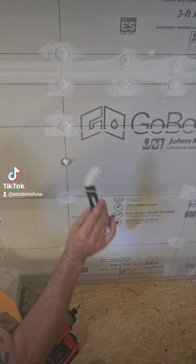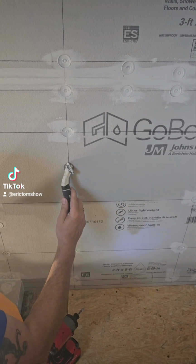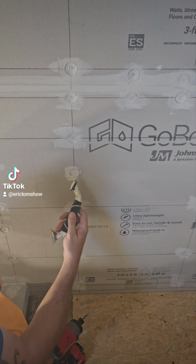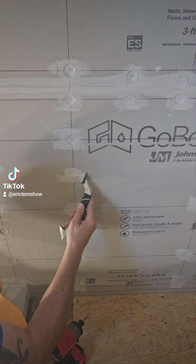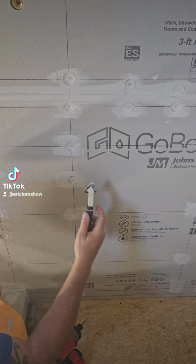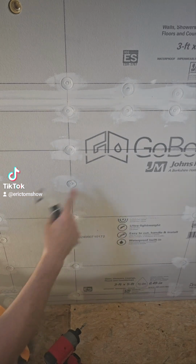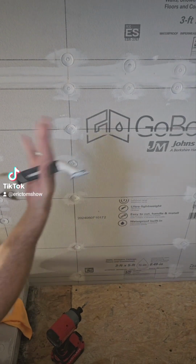Let me show you. Look, everybody's got one of these, I bet you. Take that little caulking tool. Get that blob. Work that right side, just like that. And then set it flat and run all that through. And then I go back every kind of direction here just to make sure that all those little grooves are filled, but see, it keeps all that off your hands, keeps everything looking nice.